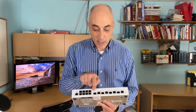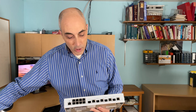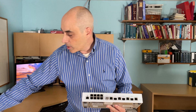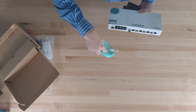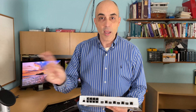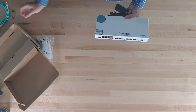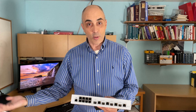What that means is you'll be able to pick one or the other port. So in case you wanted to do fiber, you would plug one of these in, then get yourself a fiber cable, plug it into here, and on the other side you would have fiber end to end — that is 10G fiber. When you purchase these, you have to have the same on both ends. Depending on the distance, that's how you would select your modules. What's great with fiber is you can go quite far — that's the whole point of fiber.